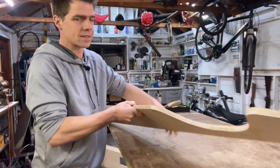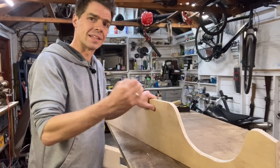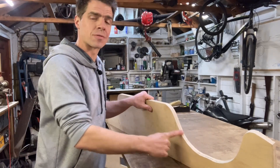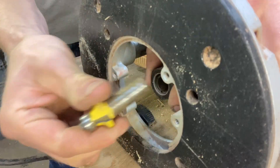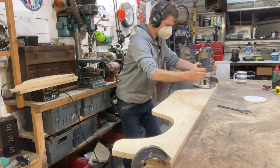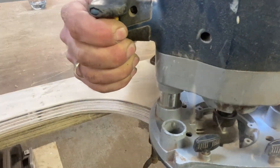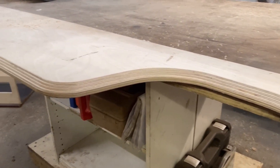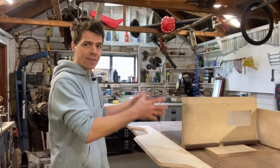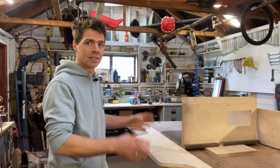The next thing I want to do is reduce this surface here. This is 18 millimetres at the moment and it's going to look too chunky on the finished car — it's going to look out of proportion. So I need to reduce it down to about six millimetres without compromising the strength of the board. The next job is to machine a groove into this surface of the side panel, because all of the weight of the body and the driver are going to rest on the joint between the base panel and the side panel, so that joint needs to be as strong as possible.